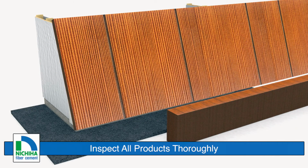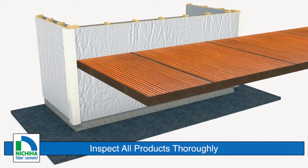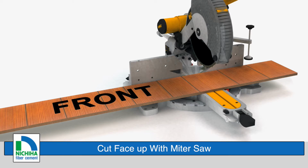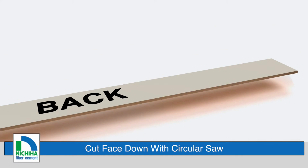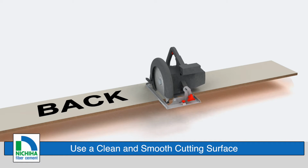Prior to installation, be sure to inspect all products thoroughly. When using a miter saw, cut the product face up. If using a handheld circular saw, cut the product face down. Ensure the cutting table does not damage the siding's finish by lining it with tape, foam, or other protective material.